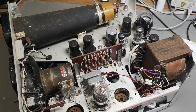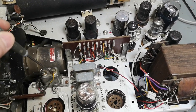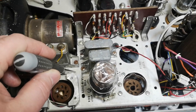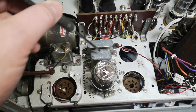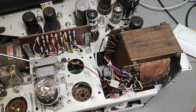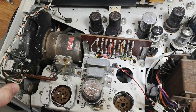Now it is a new day. I spent many hours trying to track down all the leaky components, and it is more or less all the parts — I find capacitors all over the place. They are nicely metal-encapsulated here and mounted to chassis. But most of the capacitors I've been measuring, they leaked quite a lot when the voltage is high on some of them. The transformer is also leaky. I've got really nasty problems all over this place, so I think I'm just going to pack it back together and call it a fun experience playing with it.